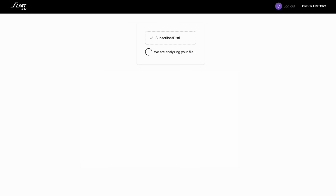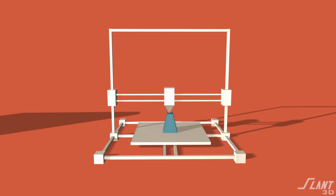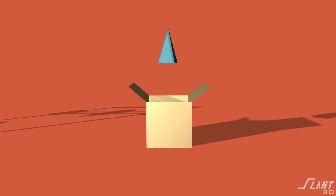And if you're running through an automated system, if you submitted something through our API or our Etsy plugin where it's blind and the part is just sliced and then printed, you don't really want to have to rely on print settings. You want to make sure that you control how that part is going to come out so that it's really, really reliable. And the only way to do this is inside of CAD. But let's talk about regular rafts just a little bit.